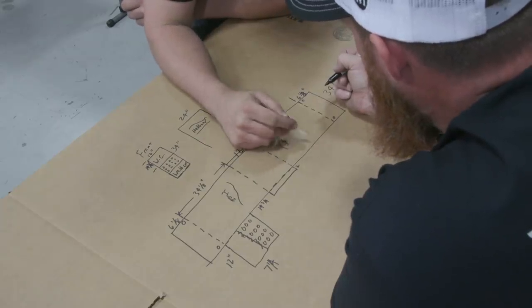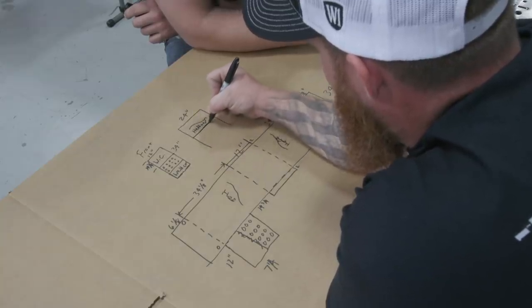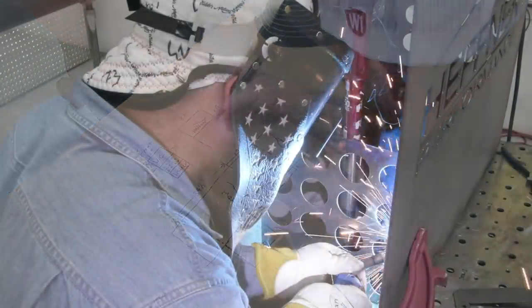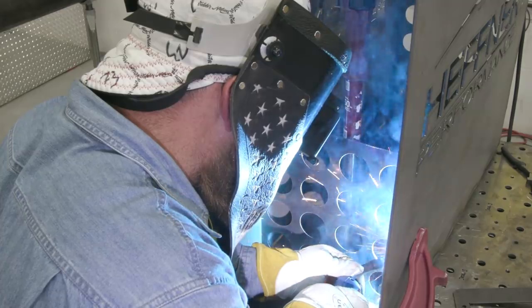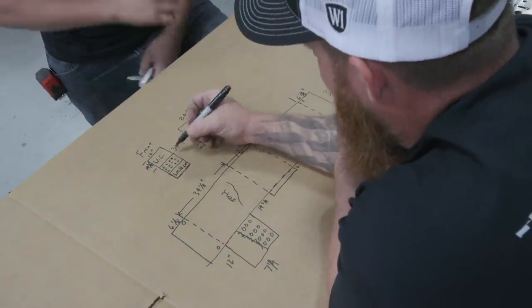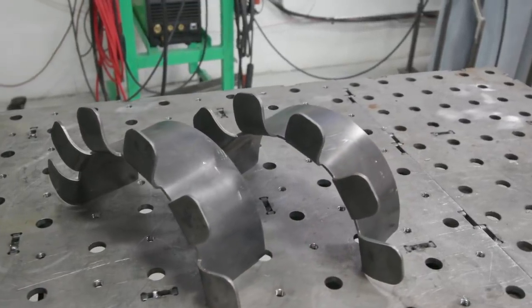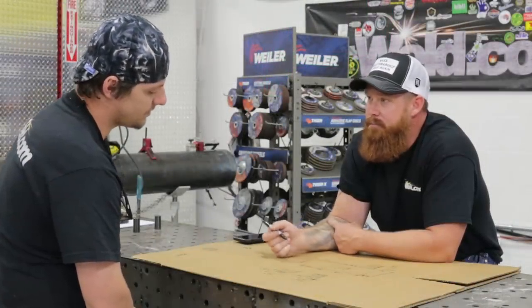For reinforcements, once we're done we'll throw some angle across the back, kind of out of the way of the logo. In the back we'll probably have to put an insert on the inside so you have your electrodes coming in there — a piece back there that's gonna receive those so they're not just hanging in there; they'll be hanging from the front, nice and presentable. We'll keep the sides clean and put some hooks on there. For the torch hoses and work piece clamps, we'd like something with a radius — not hard 90 degree edges, kind of like a hose reel — smooth. We can roll that around a piece of pipe and cut out an outline on the quickie table.